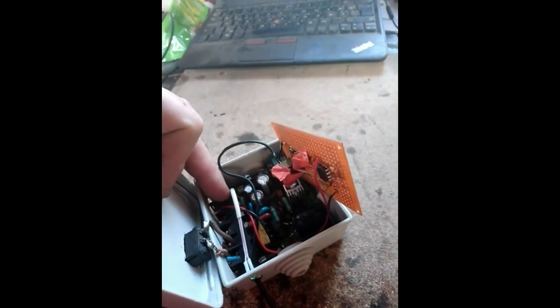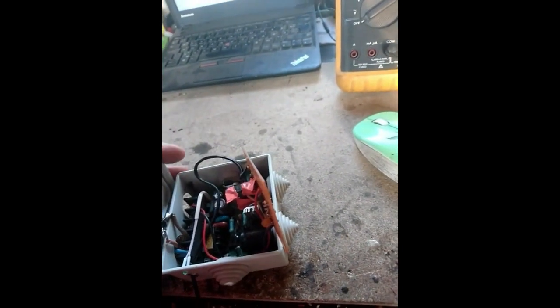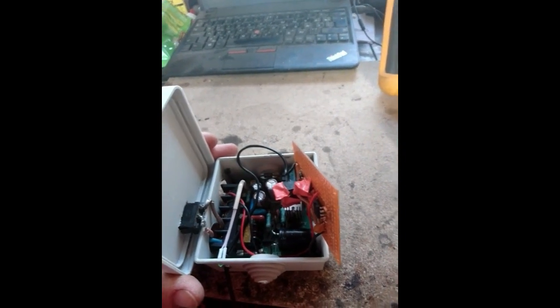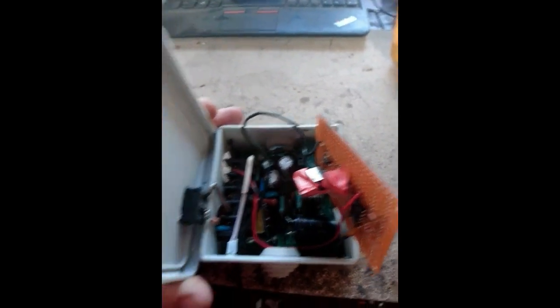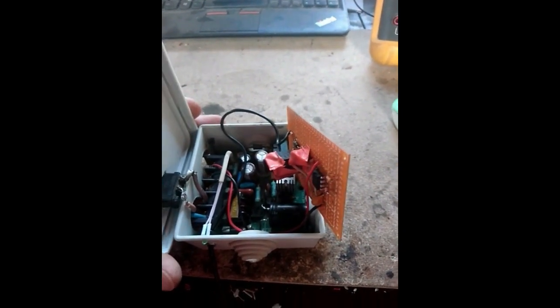The other thing I did was the LED on the SMPS — I just took it out and put it into the box so I can see a visual power indicator. You could power it from AA batteries at 6 volts, or whatever — you'd need four batteries in a battery holder. But I found it's easy to hook it to the mains, and it's not so portable that I need to move it away from the bench.